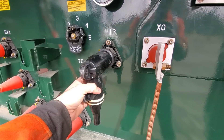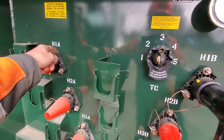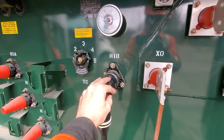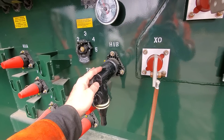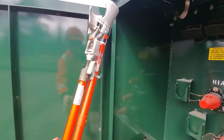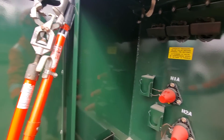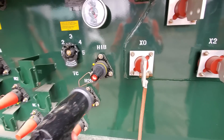If this is the feed-through side, this is the source side that's feeding into the unit that feeds through out to these, and this could take off to another pad mount transformer. So if we wanted to isolate that pad mount transformer using one of these two sticks — which we'll get into in a minute — you can remove that elbow.